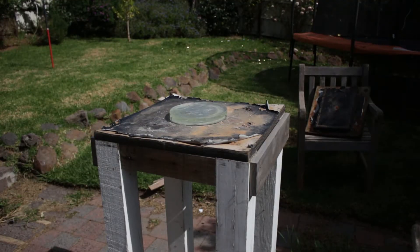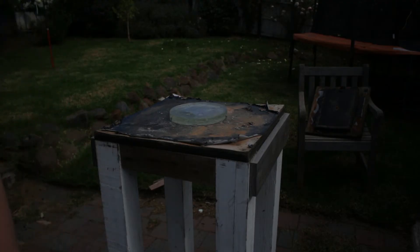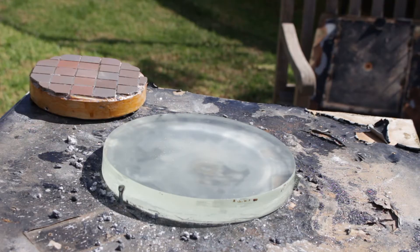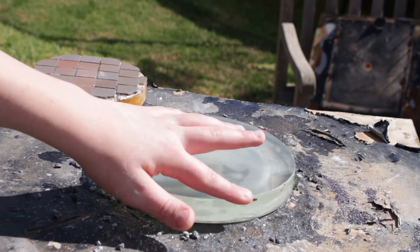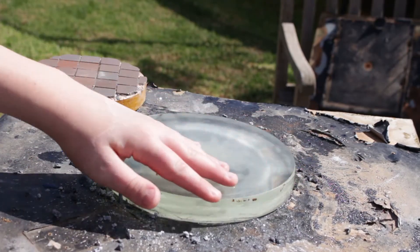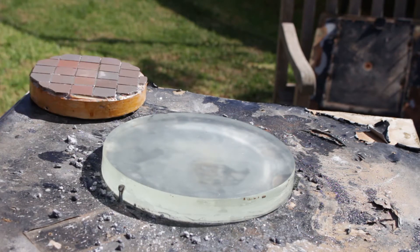Now that we have our materials, we need a working space. Be warned that this is very messy work at this stage — as Dobson would say, this is caveman work. I recommend a table that's a good height for you and that you can have 360-degree access around, meaning you can walk right around it. The mirror sits on top of this table. To keep it still I hammered nails into three points in the wood. You also need to put a bevel on the mirror edge, which is currently very sharp. The risk is that a loose piece of grit will come along and knock a big chunk out of the edge.